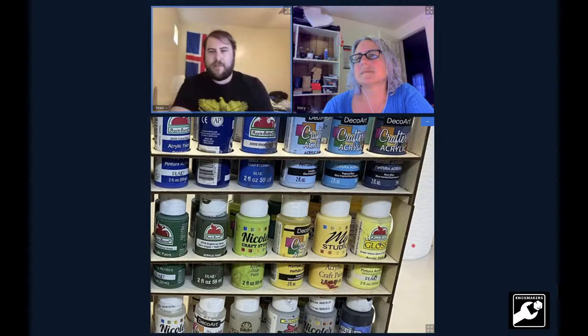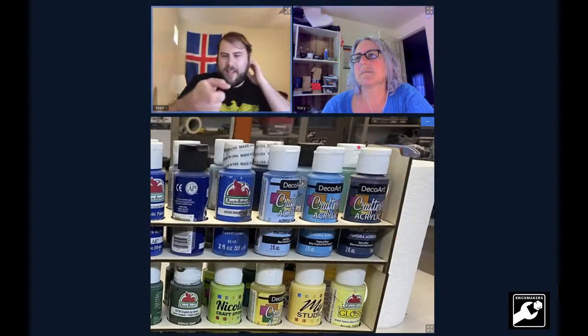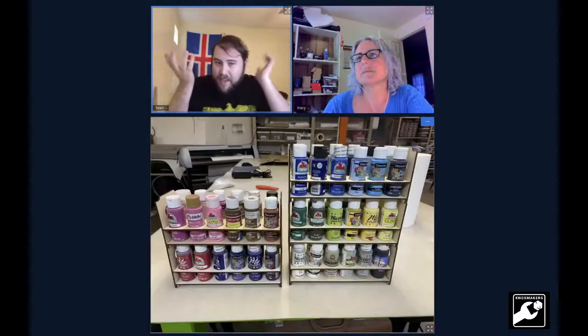The only things he actually had to glue were the little tabs in between the individual trays — just literally little popsicle-stick type things cut out of there. That's what helps them stack: it slots in, then the bottom of it has the exact same shape, and you put the little tab on the back so there's no side-to-side motion. They're pretty solid — stacked up three high without shaking at all. Pretty sturdy, and he was really happy with them.